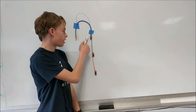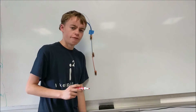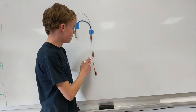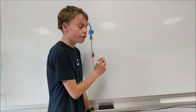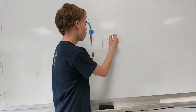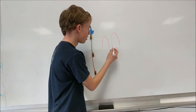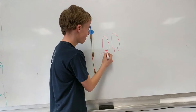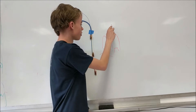Now for how this candy cane shaped infrared sensor works. It uses a phototransistor activated by infrared light and an LED that puts out infrared light. Both components look like LEDs. The phototransistor is like a normal transistor but its base is activated by light, and the other is the normal infrared LED. When power goes through the LED it puts out light in a 70-degree angle upwards.